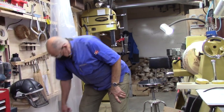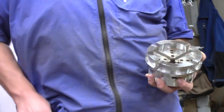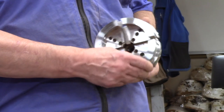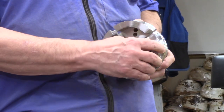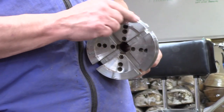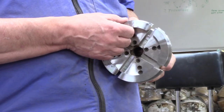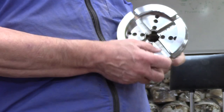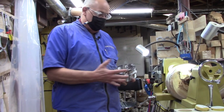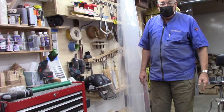My solution for holding has been to get a five-inch Titan 3 jaw set — it's quite deep, good and strong. Whenever you're doing these dovetail tenons you want to be sure the angle matches up neatly with the inside of the jaw and that the face of the bowl is undercut slightly so the outer rim is in contact. If the inner rim is in contact instead you'll lose that tenon with any catch. Since I've been doing that I haven't had any tenon failures. When coring it puts quite a load on things. Generally I'm doing bigger pieces trying to get two or three nested bowls — I'm not good enough, like Mike Mahoney, to get four or five.